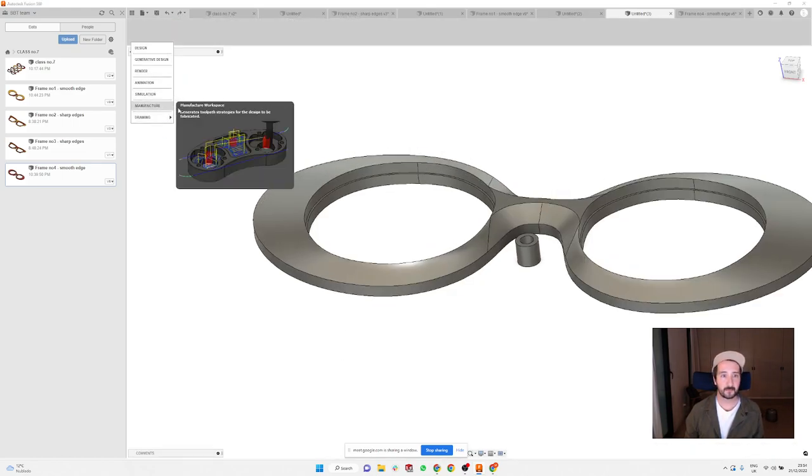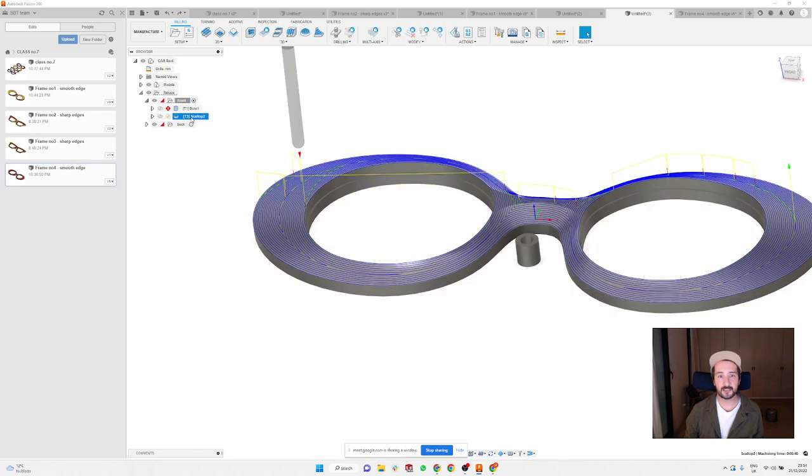And the good thing with scallop is that you're not cutting a lot of material, so you can almost go at the maximum speed of your CNC. Worst case scenario you're gonna cut 2 millimeters with a ball head cutter, so it can take any load, and you can make this operation quite quick. If you don't want any hassle at all, just put lesser gaps between each step, but 0.5, I would stick with that, and that should still look really good.